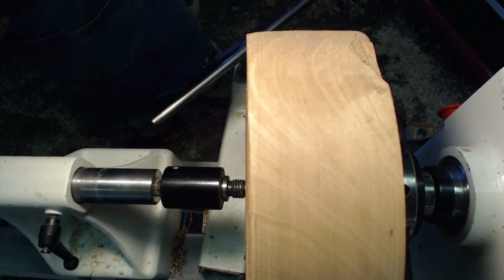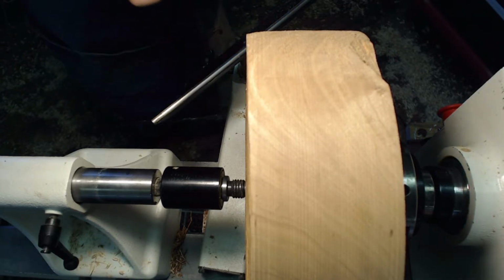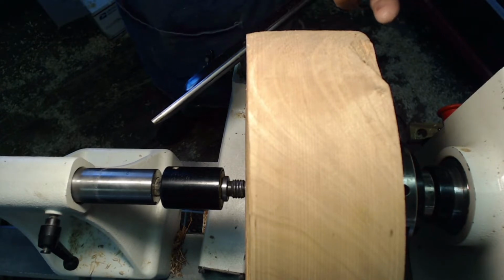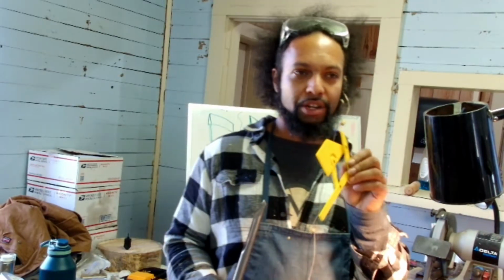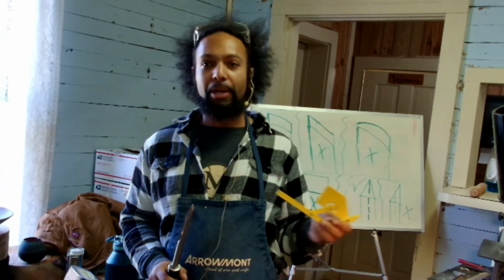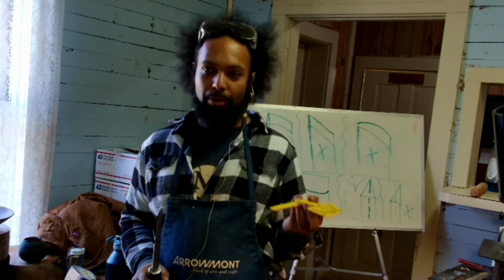And the other thing is all my tools are freehand sharpened, in that I don't use jigs at all. And that's not something I'm saying, oh, that's special. If you don't use jigs, you're better. There are great turners that use jigs. It's just that for me, I find that I have greater advantage in grinding freehand. That's how I started out. That's what I learned. And so that's a matter of preference and opinion, not of fact. So if you're shaping an exterior and someone says it's not ground at 40 degrees, you can't do it, they might be crazy.